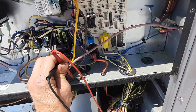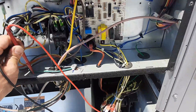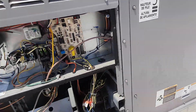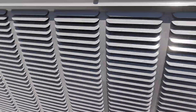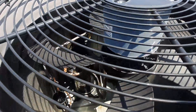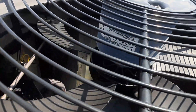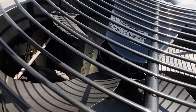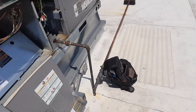Just checking to ground — I'm not getting any readings to ground. I'll have to ohm out the blower and ohm out the compressor, those would be the things that could have caused the breaker to trip. Nice plastic fan blade. Nothing too unusual down there on the compressor. We'll pop that panel off and look. It's got a TXV. These are newer units so I haven't really dealt with too many of them. Let's go find the breaker first and go from there.